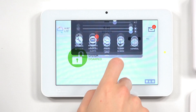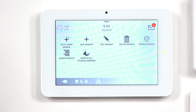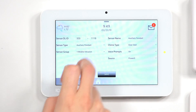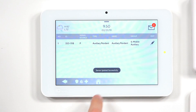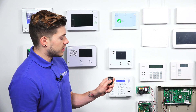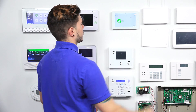Now I'm going to show you what the medical panic sounds like. Swipe down from the top, Settings, Advanced — enter in your dealer or installer code. Go to Installation, Devices, Security Sensors. This time I'll do Edit Sensor since it's already learned in, and hit the little pencil icon on the right-hand side. I'll switch this down to a mobile auxiliary. This is the one that's going to give out small little sirens — it makes the siren sound for a couple of seconds, turns off, a couple of seconds, and turns off again.